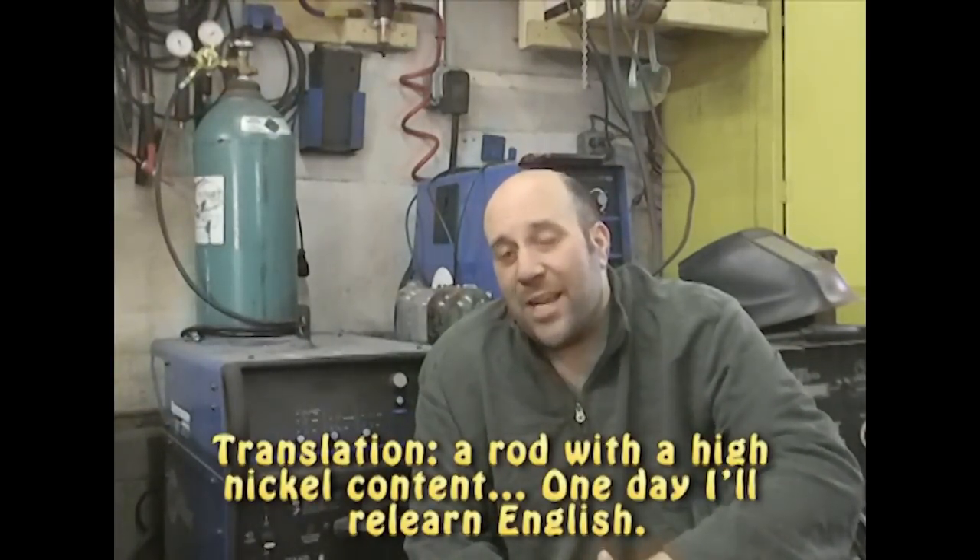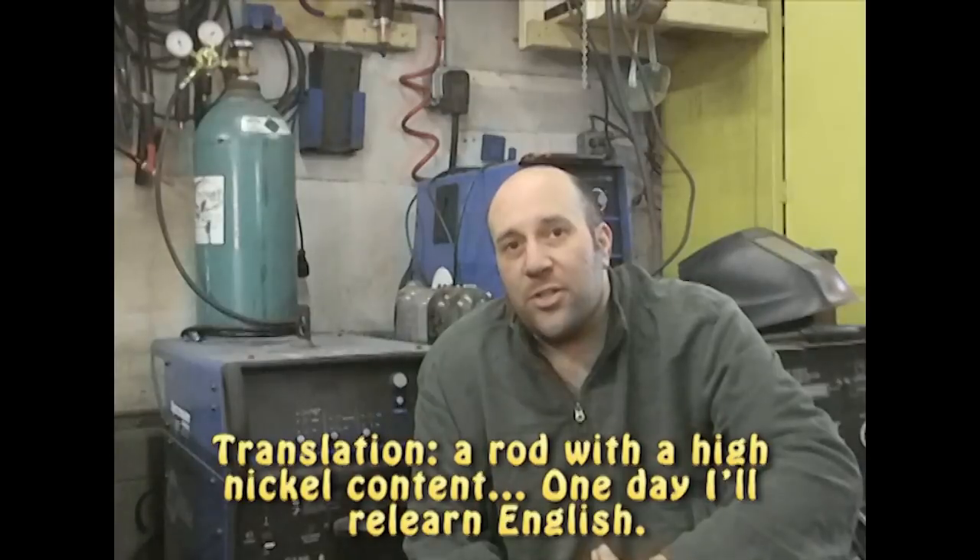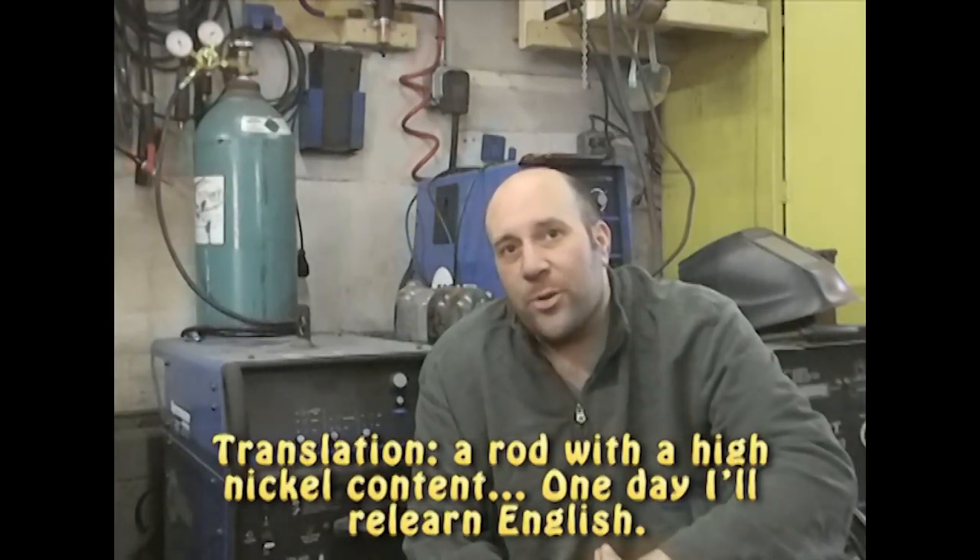Hey YouTube, it's Jeff at Darkwind Metals. Dana and I had an interesting project come into the shop a couple of days ago and we need to get it done. What we have is a cast iron stove door that has a crack along the bottom and a hinge that's been broken off. Normally we can do this type of repair with brazing or stick welding with specialty electrodes, but today I'm going to use a high nickel rod and TIG weld it back together. TIG welding presents its own challenges, but it also produces a really good clean weld on cast iron. It just takes some time and a little bit of patience. Let's get started and I'll show you step by step what we're going to do.